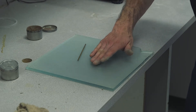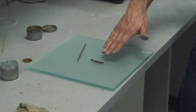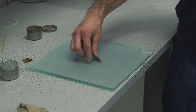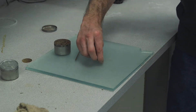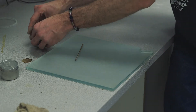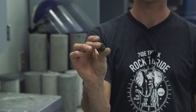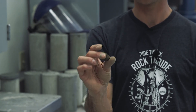I'm almost there. As we can see now, it's beginning to crumble and fall apart — I can't roll it anymore. It's breaking to pieces and we have not achieved 1/8 of an inch. We then take these crumbles and put them into a tared container of known weight and seal it. We repeat this process, taking another 2-gram ball off of the 10-gram sample, until the entire 10-gram sample is used up.